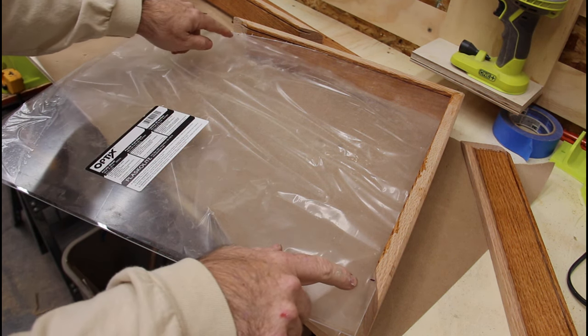So I've got this piece of birch quarter-inch plywood. I'm just going to line this up on the factory edge on the bottom to this corner, describe the shape, and then measure in three-eighths of an inch from each of these three lines to replicate this rabbet. This piece should fit right in the back. So I did a rough cut out of the triangle — this is the factory edge and I did these with the bandsaw. They're not perfect, but they're good enough to ride along the fence and give me a nice straight cut with the blade. I've got this set from three-eighths of an inch from the fence to the outside of the blade because the waste is going to go in between.